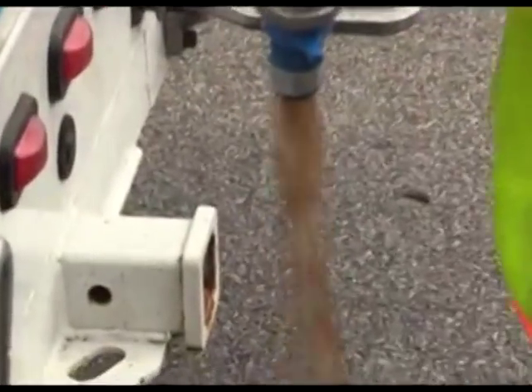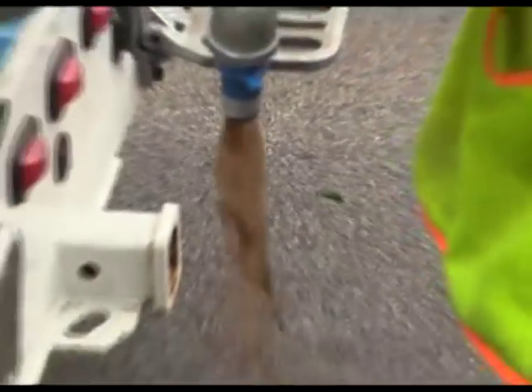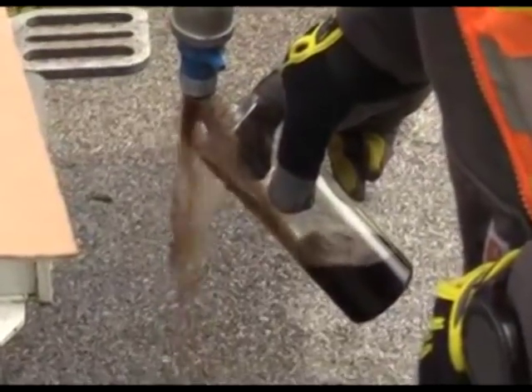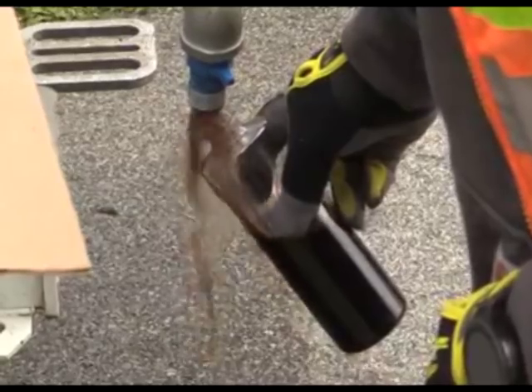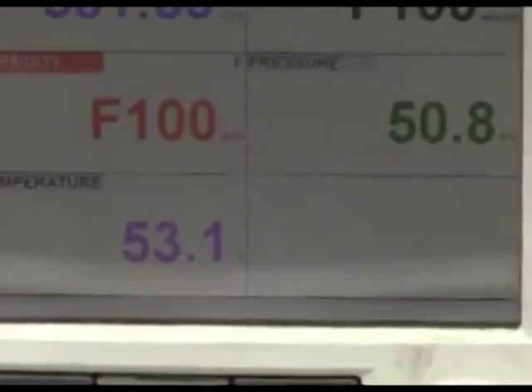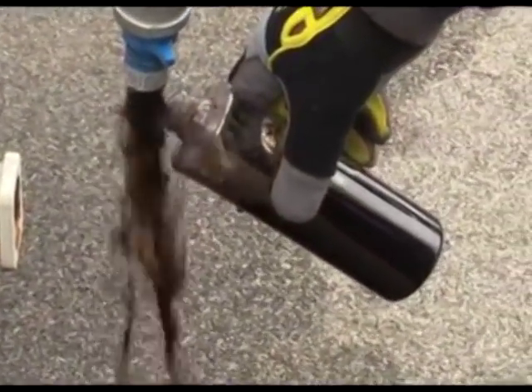The only difference with the ice is it's a little more saline — saltier — and we remove it all out as we go at the end of it. What you're seeing now is the water coming through, removing all the buildup on the side of the pipes, and it's coming out dark because it's the iron and manganese we're pulling off. We use a monitor there to watch the temperature — standard temperature and pressure are watched the whole time inside the pipe — so we can tell when the ice pig is approaching.